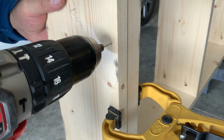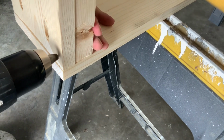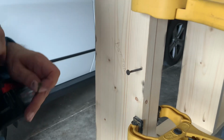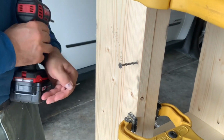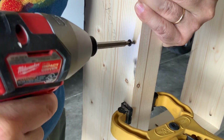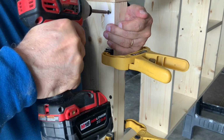And this is the last shelf, and that is where the whole unit will attach to the door. So he has 2 pieces of wood installed there to make sure it's supported, not too long, and uses that to attach to the door. We don't want to split them. He attached that piece of wood, 1 by 2, the same width as the unit.